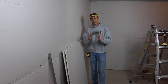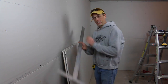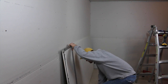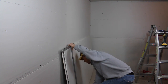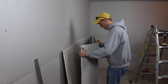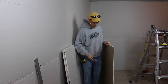So we have our measurement — the short distance was 82 inches at the bottom and 82 and a quarter at the top. I'm going to mark 81 inches and take our T-square to make life easier. I'll put my foot down at the bottom to hold it and just score it halfway down, then pull it halfway up, and do it again to make sure we get a nice clean snap. We've got the score line. I'm going to take the sheet and pop it back to break it, then get in behind the sheet with my knife and cut it halfway up and halfway down — and we're ready to go.